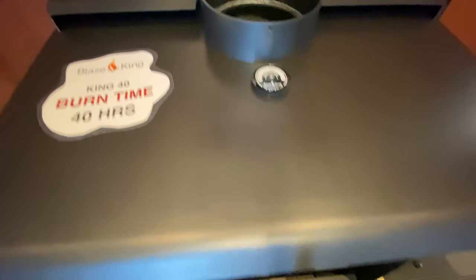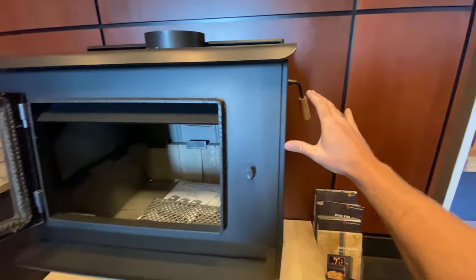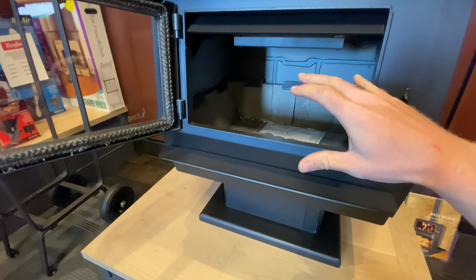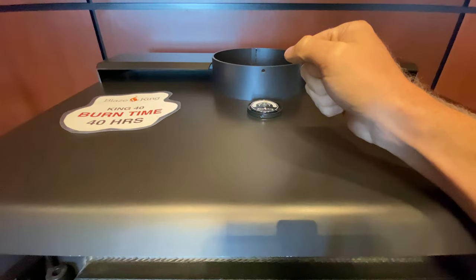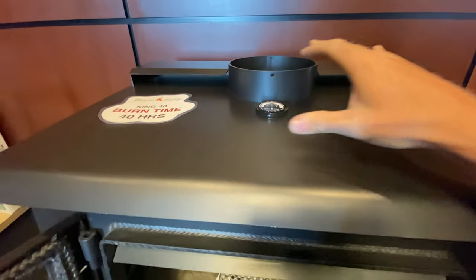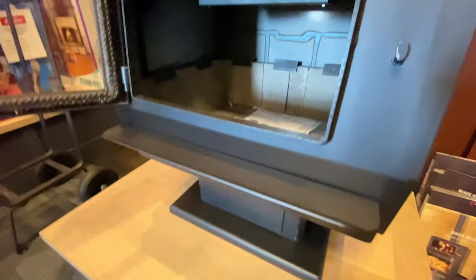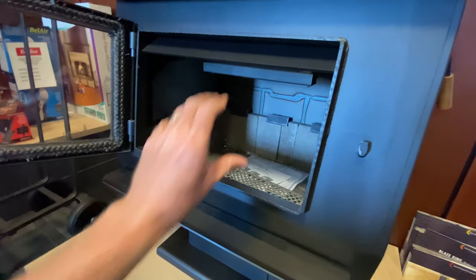I keep an eye on the thermostat, and once it gets into that active zone, you reach over and grab this manly handle and click it down. That totally shuts off the primary flue and now draws all the air through the catalyst. You're going to see the catalyst up there start glowing red hot and the fire characteristics change almost right away. I'm monitoring it for where it's standing — if I've got a bunch of doors and windows open, it's automatically going to crank up, open up that thermostat, and allow more air through. So it really is plug and play. You're not messing with a pole changing airflow for the primary combustion. The magic happens up in that catalyst.